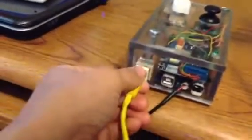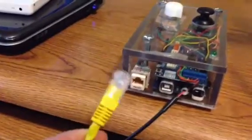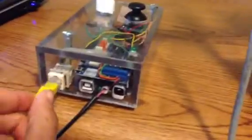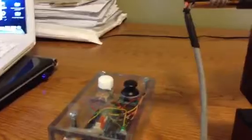Since I didn't have one set cable length, I used Cat5 for the connection — four wires for each motor — and that works nicely because now I can have any length. If I want a shorter cable I can use that, or I can go up to 120 feet, I think I calculated.